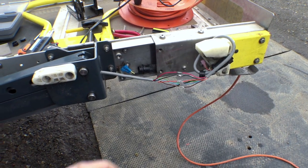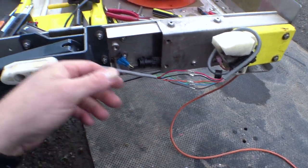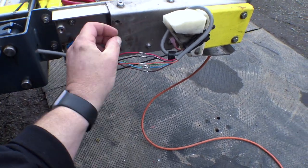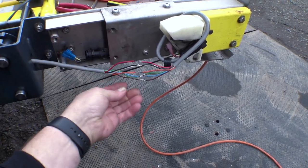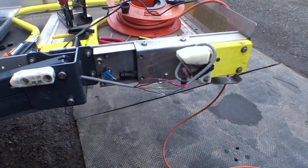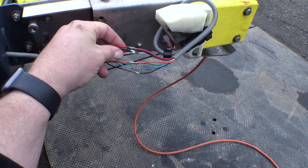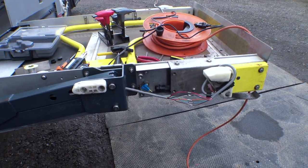Okay, some time has passed. We're on the home stretch — I've got all the wires soldered up here. Turns out it's cold enough out here that trying to heat this aluminum wire, my 140-watt soldering iron was having a heck of a time. It took about three or four minutes to solder each one of these. Some of them look pretty atrocious, but I can assure you there are no cold solder joints. My heat shrink is inside that luggage bay, which there's absolutely no way I can get to right now. So we're just going to have to electrical tape all these, which is a little annoying — it's a lot nicer to use heat shrink. Ready to plug this back in and start putting things back together.